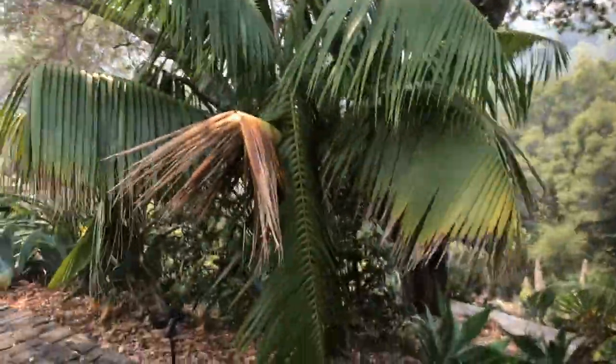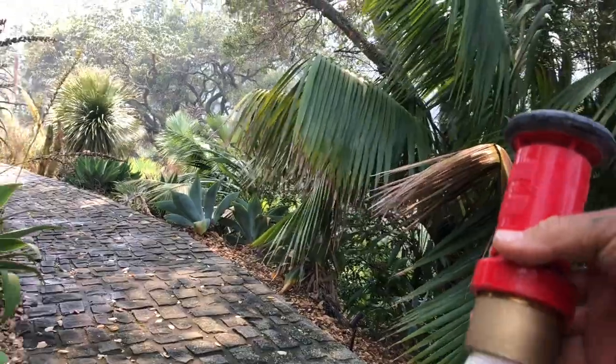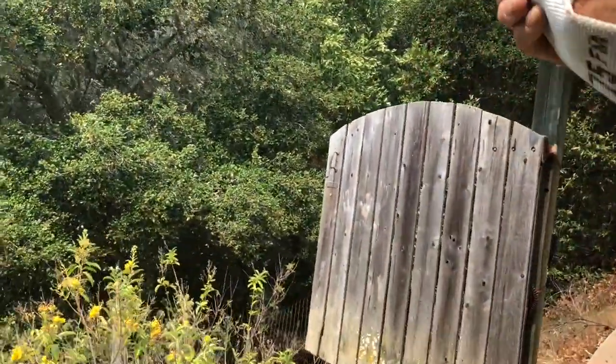I can leave the hand valve shut on the fire hose, and my daughter can soak this property down really good while I run to the store and get a brass inch-and-a-half ball valve. That'll separate the water so we're not relying on this temporary setup — this valve is good enough for the hose but it'll leak. A permanent valve would be more proper; I should have done that long ago. We're going to stretch it out and have it totally ready to go.